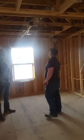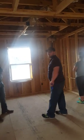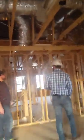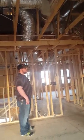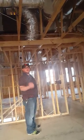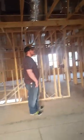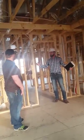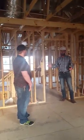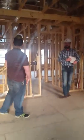There was one thing. I saw these up in the front of the room, and I was just making sure these aren't actual vents, these are just inlets, or are they actual vents? So for this size of a room, that's going to have a filter in it. It is a mini return for this space. You're looking at almost half of your upstairs, so they have to upsize that return. Yeah, no, I did that on purpose.